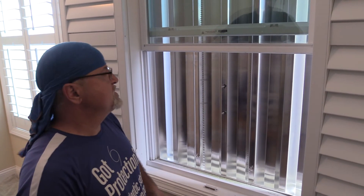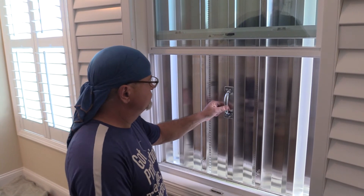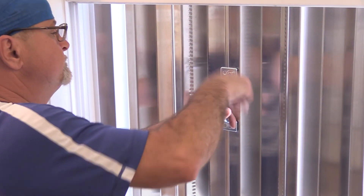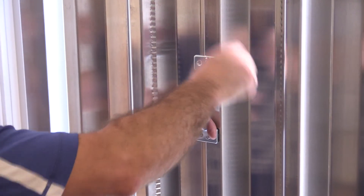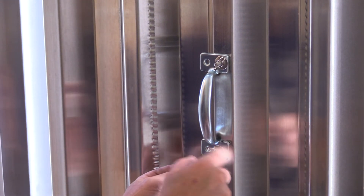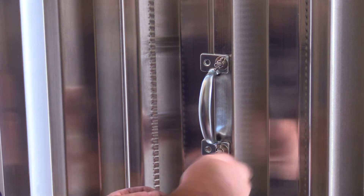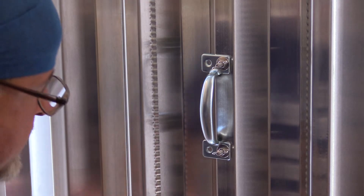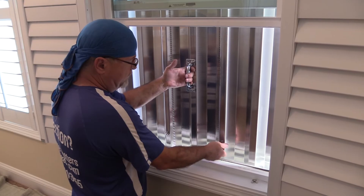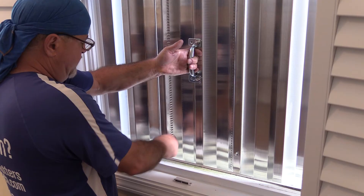To remove the upstairs insulation from inside the house, we take the reusable handle and install it with two wing nuts and tighten it up. We remove the two attaching wing nuts that hold the center panel in. I've got my hand on the handle with slight inward pressure — it rests on the stud so we're not supporting any weight. Remove the two wing nuts.